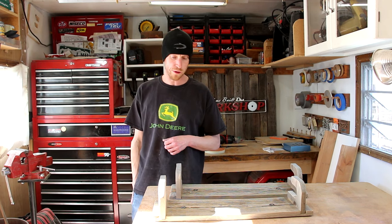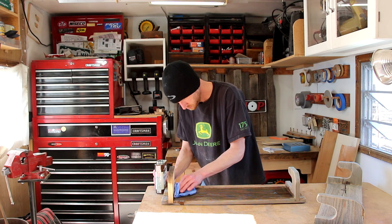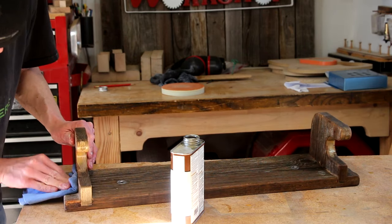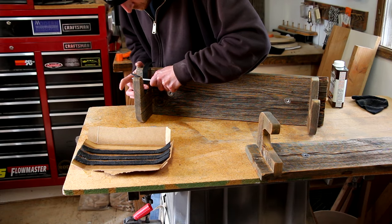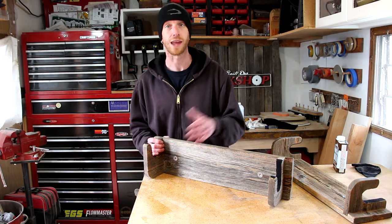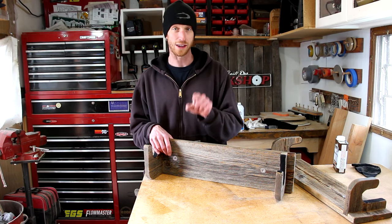Originally my plan was to use no finish, but since I had to cut and splice some boards, I'm going to go ahead and use some Danish oil. That way it soaks down into the cracks and conditions the wood pretty well. I like using Danish oil anyway — it's really easy to apply. You just flood the surface and rub it in. Now using some spray glue, I'm going to glue some felt into place. I'll use a screwdriver to help push it down into place and make sure it's glued securely, then trim off the excess with a razor blade. And they are done. I think they came out really cool. Pretty happy with this project — it was pretty simple, not really a whole lot to it. Good use of these barn boards. I really hope my friend will get a lot of good use out of these.